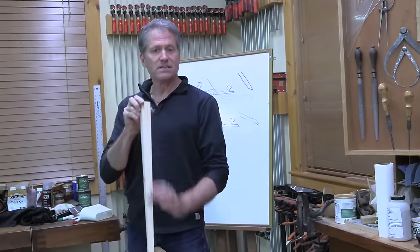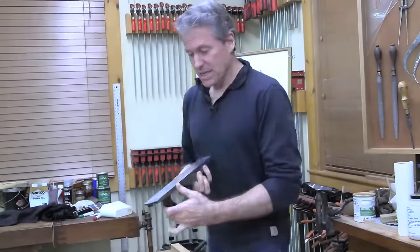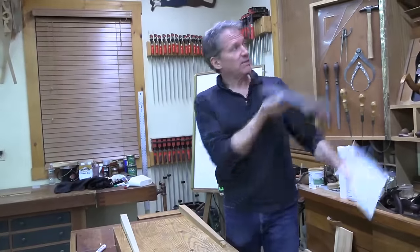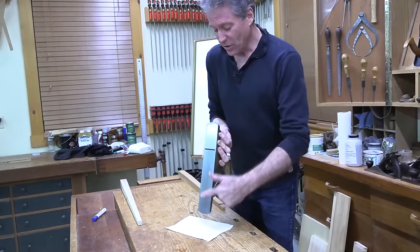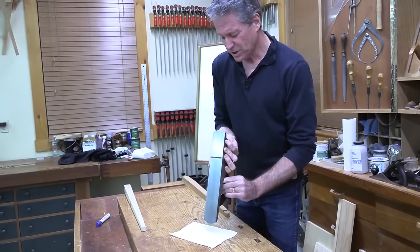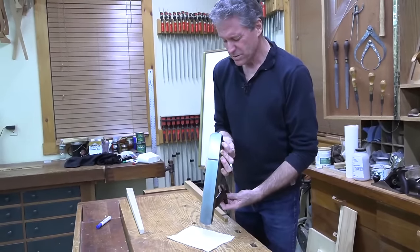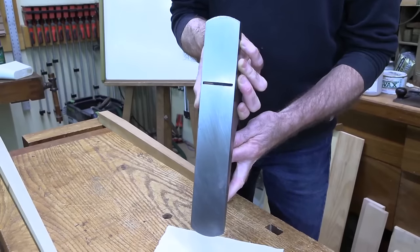I've got a tapered leg here - these shine beautifully making this kind of cut. When setting up, I like to look at the iron coming above the sole of the plane. I usually look at it against a white wall or a piece of paper on the bench, holding it so I can see the whole sole reflecting off the paper. Then I can see the blade come up above the sole. I'm cranking it down, starting to see it - I'm high on this side so I'll push the adjustment lever over until it looks about parallel, then back it off slightly.